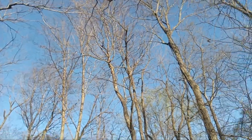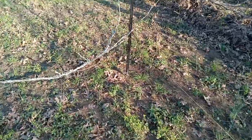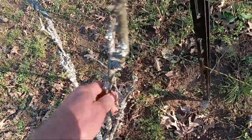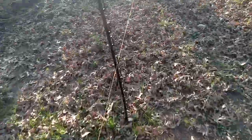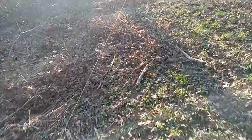It's right up here - I see it. One of these dead trees dropped this limb on the fence. And when the wind blows it touches the fence like that, and it's causing some trouble. What happens when the wind blows is it grounds out the fence and stops the shock - all the shock goes down through that stick into the ground and it can't shock anything else. It's done shocking.